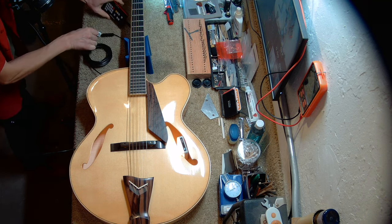Here we see Jimmy's signature — we'll have a look at that. But we want to look at all the glue joints. That's the end block — that's where the tailpiece is. The light is over there and we can look at his work on the inside. This is the neck block. There was a little bit of squeeze-out here, which is actually good because there are no gaps. This is the most important glue joint on the entire guitar — if this is no good, the neck will wiggle. This is Jimmy's work on the inside.